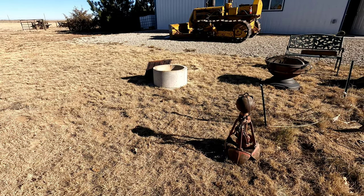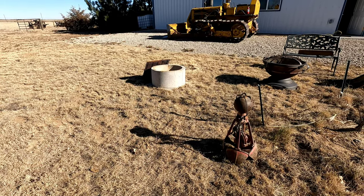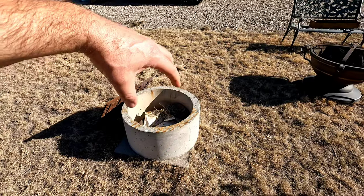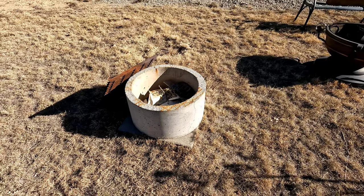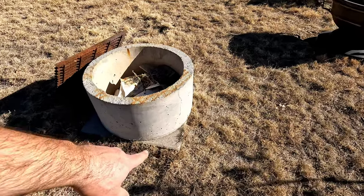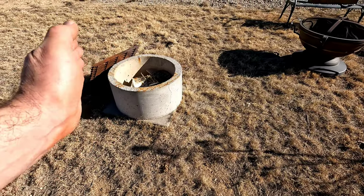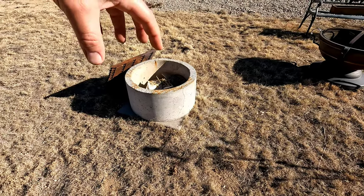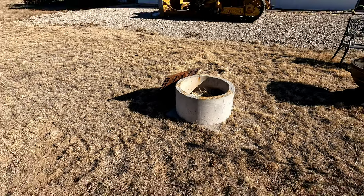The clay material where they were digging is super hard in Colorado, so sometimes they'd bring in the cable backhoe or a machine with a ripper to get started and get down through the hard pan a couple of feet. Then they'd bring out rings on a truck — there was a lift ring with pins to pick them up. The very first ring had a tapered cutting edge on the bottom, so the weight of the ring would drive it down and cut the dirt. The job of the orange peel bucket was then to go in the middle and clean the material out.